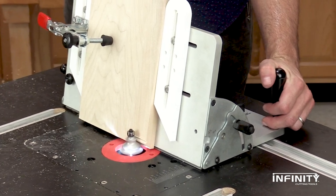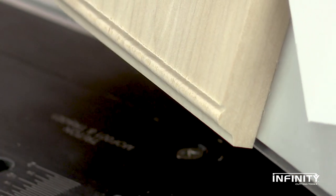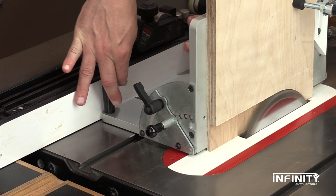With the vertical fence angled, your workpiece can be guided by the bearing on the bit or the miter bar to create a unique profile. Guided against the table saw fence, a dado stack can make a rabbet in one pass that is impossible with a router bit.